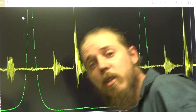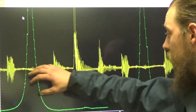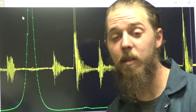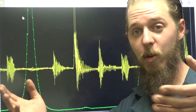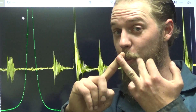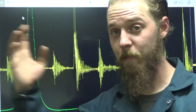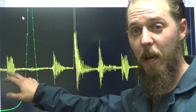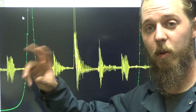I used a passive piezo pickup on a mechanically injected diesel. What does a mechanically injected diesel have to do with a hydraulic system? It's the same thing — it's got a pumping mechanism, lines to transmit fluid, it's pumping fluid at high pressures, and it's performing work. We used a passive piezo pickup which was used for a diesel tachometer.